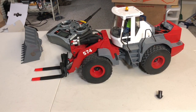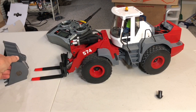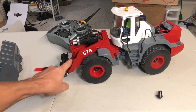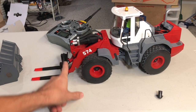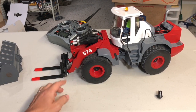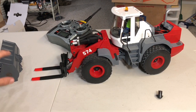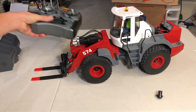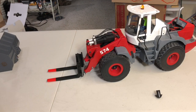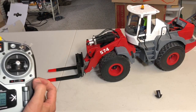Here's where I mastered a new design for the fork plate. Once I get this third pin in, as you can see, this fork plate is sitting exactly the same angle as the bucket did — because I took the geometry off the pin hole markings, the length of the curl arm, and the bottom lift arms, and came up with a number that allows this fork to sit perfectly straight with the back plate having a pitch to it as it should. So you don't have to adjust anything on your transmitter — once you adjust your bucket correctly, your fork is set correctly.